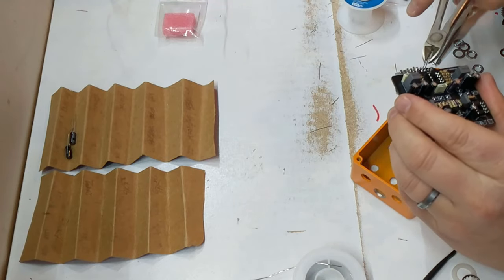We need to throw in our audio jacks — that'll be the last wiring we need to do. I've got my two audio jacks, they need to go in here. The best way to start this is to actually get your ground leads in first, so I'm just going to attempt to do that. Now we can screw these guys in, run these wires along the side, and we'll solder these last two pieces in. And there we go.